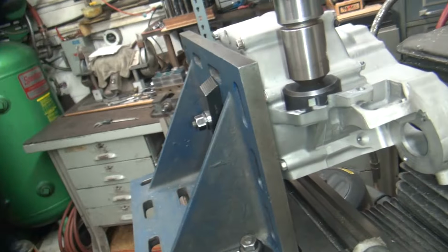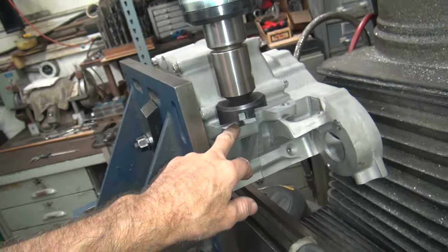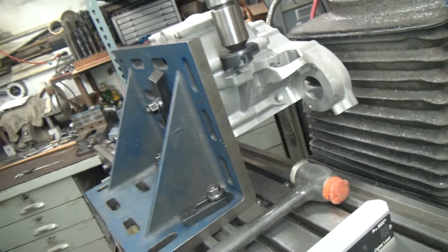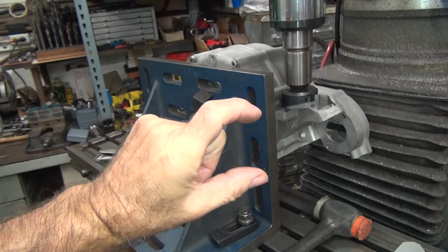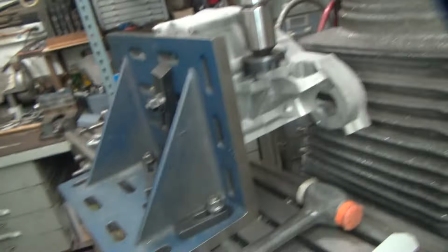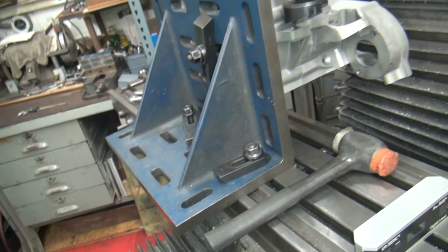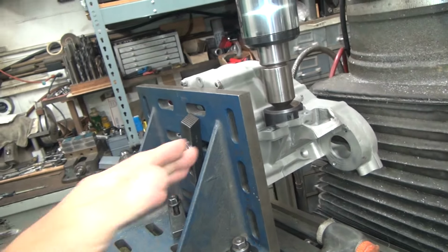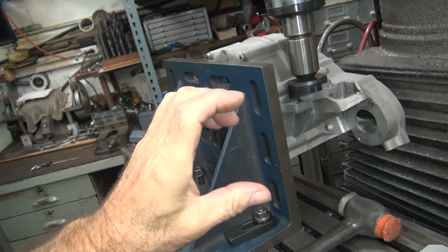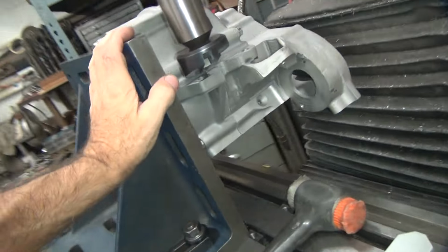The other problem is there's an offset difference between this side and the other side, and we're shooting for a 1.650 difference, which is your distance from this cutter to this cutter. And the problem is that to get those angles, the mounts in these cases will be probably at least a couple inches apart, and that's not where it's supposed to be either.